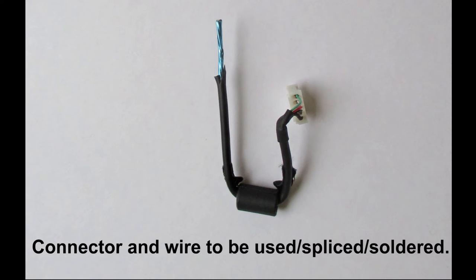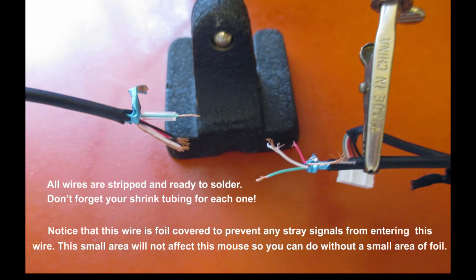Cut the wire about four inches from the connector, so that it falls right over the circuit board. Then cut out the damaged part of the wire where you think it's broken. Stripping the insulation from small wires like this is not easy. I made a small slot in it with a razor blade, and my fingernail would easily pull that off the rest of the way. Strip these wires back enough to make a connection, but also cut the outer shield back far enough that when you slide your shrink tube on there, it'll be far enough away from the heat that it won't start to shrink.